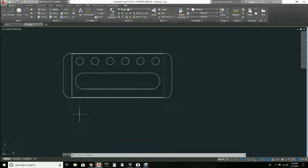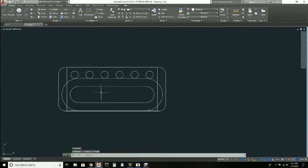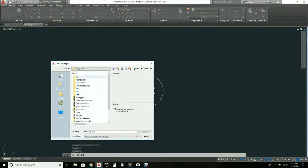I think at this point I'm trying to figure out what I'm gonna do. What's the most clever, needlessly clever thing I can do? And I just end up offsetting it, which is what I did. It's perfectly smart. So I don't need any of that other stuff. And then I offset the magnet, I think 5/1000ths all the way around, so that I had a little extra space.